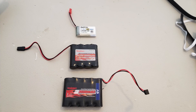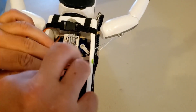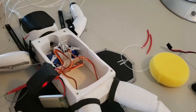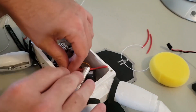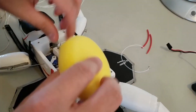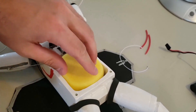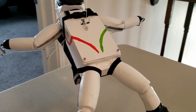The last thing I managed was finding a couple of smaller batteries. A 4.8 volt battery — the same as the bigger six-volt I already had, just one cell smaller — lets the battery sit flush with the back panel. That brings the skydiver's total weight to one pound 6.8 ounces, which is less than a pound and a half. I also found a much smaller 3.7 volt LiPo battery that brought the total weight down further to one pound 3.8 ounces, though I had to do some hacking with the connector to get it to fit the receiver. The receiver requires at least 4.2 volts to operate, but since 3.7 is the nominal charge and it's a little more when fully charged, I decided to give it a try — and it powered the receiver and moved the arms.